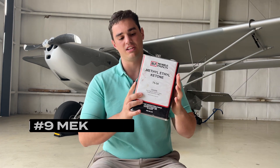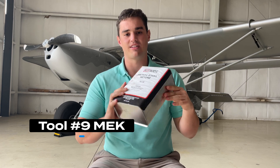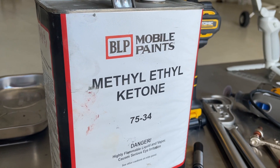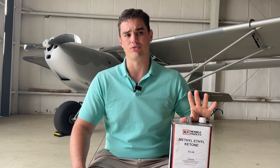Number nine is methyl ethyl ketone — MEK. This is definitely not a standard household tool, and it's not even really a tool, but it's a really important solvent specifically for the polyfiber covering. It's very useful throughout the entirety of the build. When working with Kit Fox kits, there's a lot of hysol, varnish, and other chemicals, and MEK pretty much eats through all of it. Rubbing alcohol, denatured alcohol, and acetone are useful too, but it's very difficult to replace the efficacy of MEK.